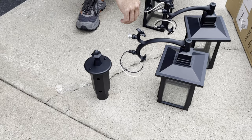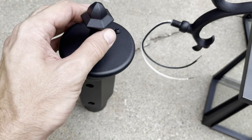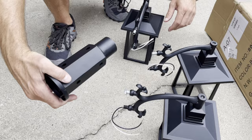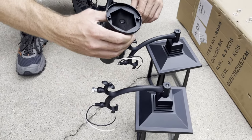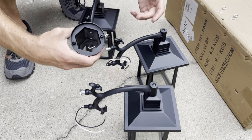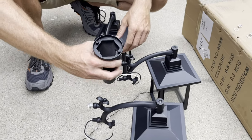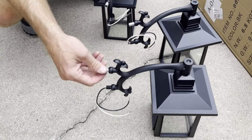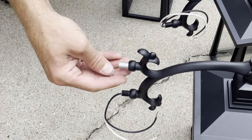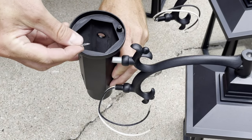When putting on the top piece there may be a couple of screws — this one does have them. Remove those and it reveals the next piece that screws onto the top of the post. Now it's time to put the lights on. You can either screw this piece onto the top of the post and then put the light globes on while it's on the post, but I think it's better to do it on the ground and then screw the whole contraption on at the same time. The nuts on these came pre-installed. Some lights may have a nut on the bottom one too. The lock washer goes on the inside of the piece, then put on the washer and the nut.